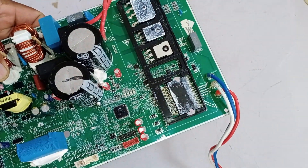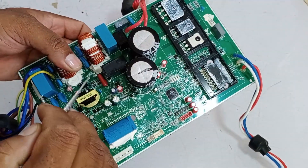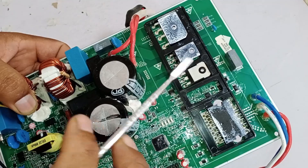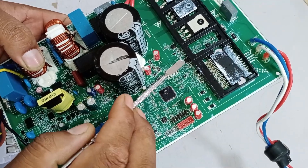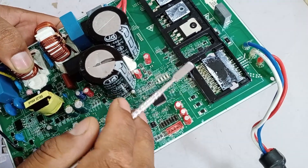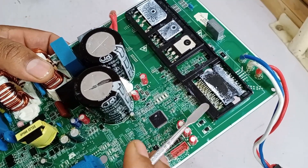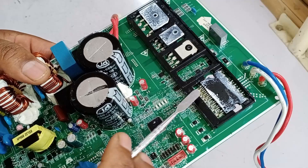For example, in a heavy short circuit, the high side of the circuit can get damaged — the PCB becomes completely dead and the unit displays the E0 error because communication is lost. If the PCB powers on but cannot drive the compressor, the problem could be due to a shorted IGBT or diodes in the compressor drive circuit, or failure in the low side of the IPM such as a damaged resistor or transistor. Certain components like resistors or capacitors lack a sensing system — if these fail, the PCB won't detect their condition but will still generate the E9 error. The system also requires 5 volts and 15 volts for operation; if either voltage is missing, the system will not function properly, resulting in the E9 error.